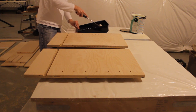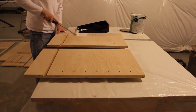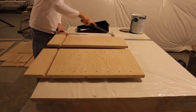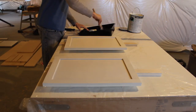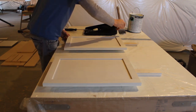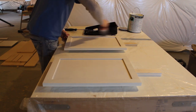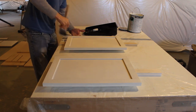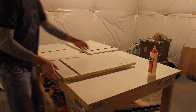The best paint is spray paint, but if it's too cold you can use regular paint. I'm using regular semi-gloss latex paint here to match our trim. I'm doing two coats on the interior parts, and the doors and face frame will get two coats of primer spray paint and then I'll brush on the semi-gloss latex. For the doors and face frame I want the brush strokes to go in the direction of the wood along the length of each board, so there's definition where one board ends and the next begins. You can also use a roller in the center sections and then brush them flat to remove the roller texture.